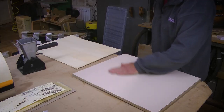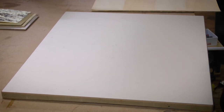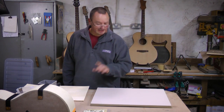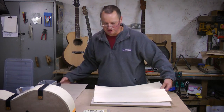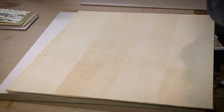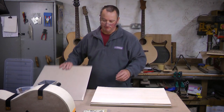This dish has been CNC machined — it's used for laminating the back. The radius is 28 feet exactly, which is a fairly standard one. It has a high-pressure laminate surface, like a four-micron surface, which is pretty non-stick. If you wanted to go belt and braces, you can also put a piece of PTFE glass cloth on the mold, but in this instance we'll leave it as is.